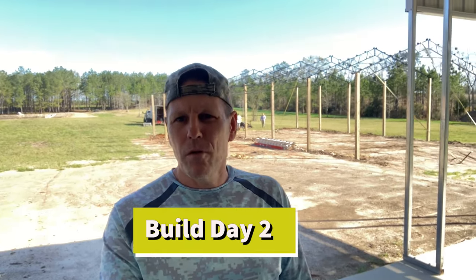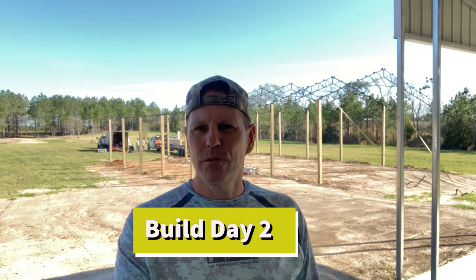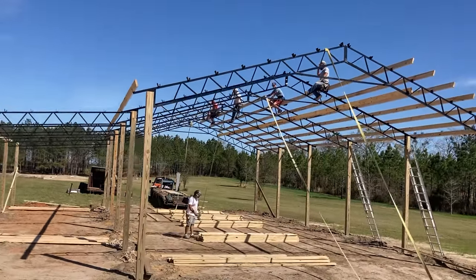Alright folks, it's day two of the pole barn build — another beautiful sunny morning here in northwest Florida. Today's plan is to put up the purlins on those trusses, and there might be some sheet metal arriving as well. I just talked to Cecil from the subcontractor and he said they might get to the sheet metal today, but it's going to be all about squaring up the trusses, running the two-by-six purlins, and running the fascia board around the outside.